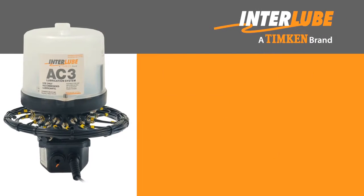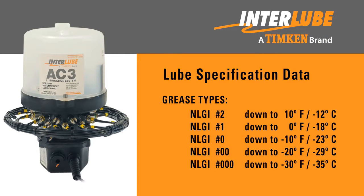Here are the common grease grades with a corresponding low-end temperature range. Generally, you would use an NLGI number 1, 0, or 00 in colder climates with prolonged low temperatures below 10 degrees Fahrenheit. The NLGI 000 is used in extreme low temperatures, down to -30 degrees. A good year-round grease grade for southern regions is NLGI number 2.